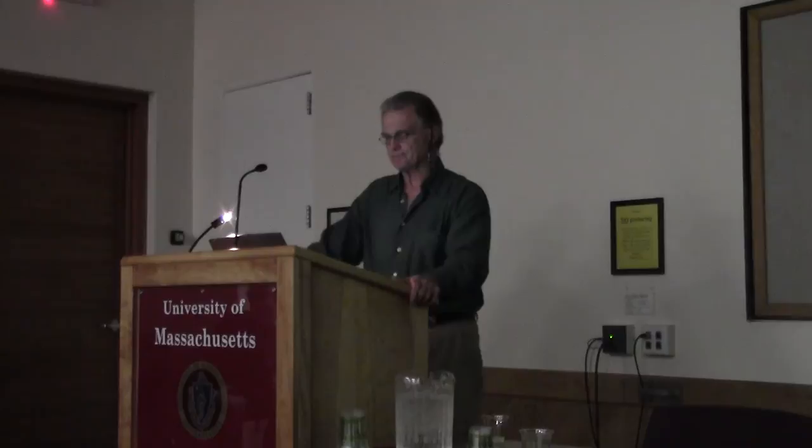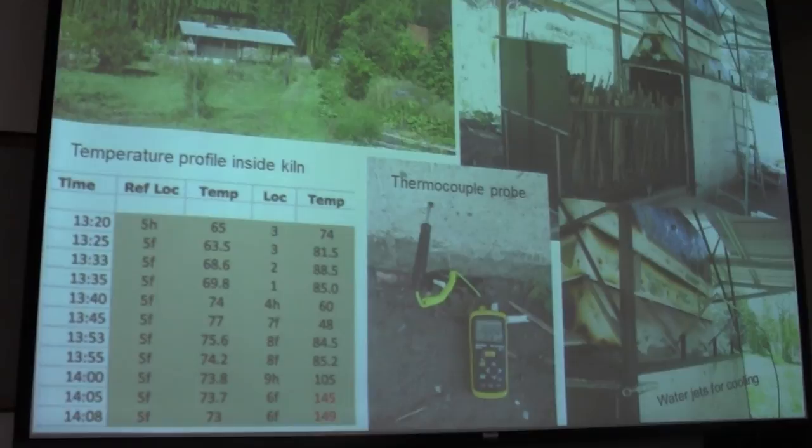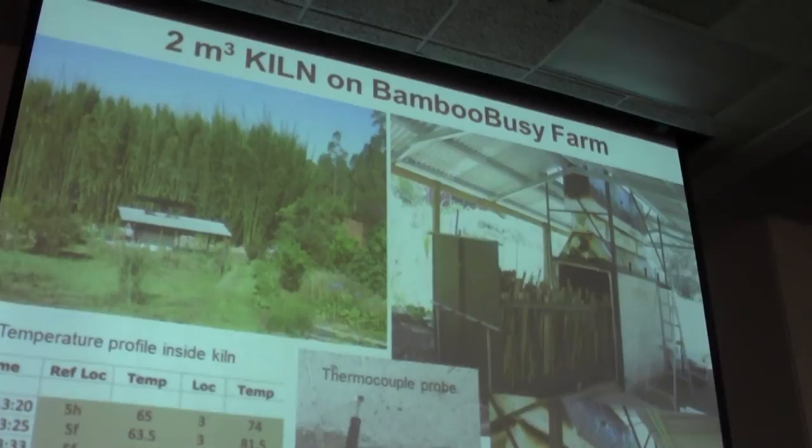The cart actually has a door attached to it. So when we wheel the cart in, we wheel the door in, and it closes on a seal, because the lady who commissioned that, a bamboo plantation owner, was elderly and she wanted to be able to handle this by herself. So here you see the cart loaded with bamboo stacked vertically, so the heat transfers well up through the bamboo. Sometimes we soak the bamboo in mud like traditional cultures, or fill it with chicken manure inside the bamboo. But we stack it in there and start heating it with the firebox.